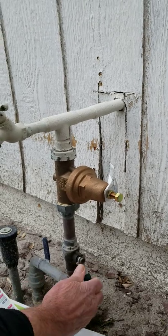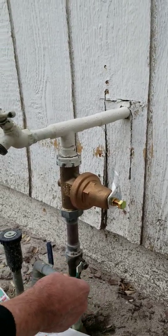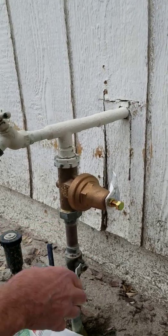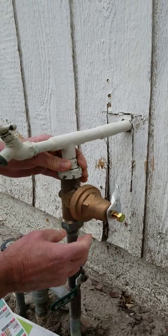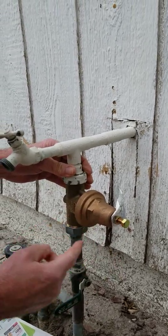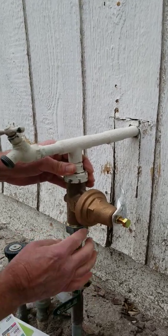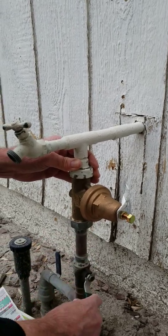You do that by holding this steady and using a plumber's wrench to loosen the unions. First you have to turn the water off and open up a couple of faucets in the house so that there isn't going to be water coming in when you put it in. Just remove these, replace it with the new one, make sure you use the new washers, and make sure it's tight.